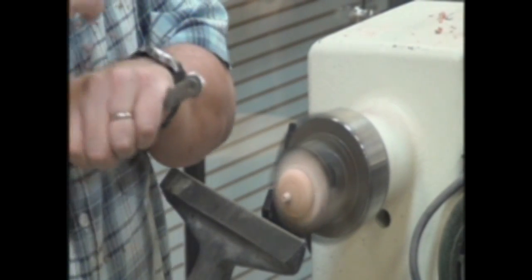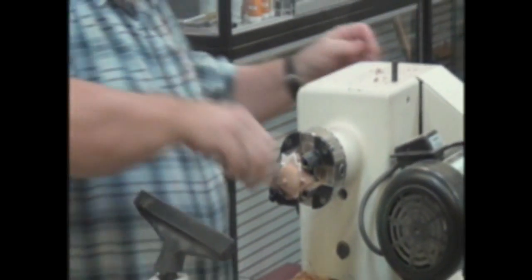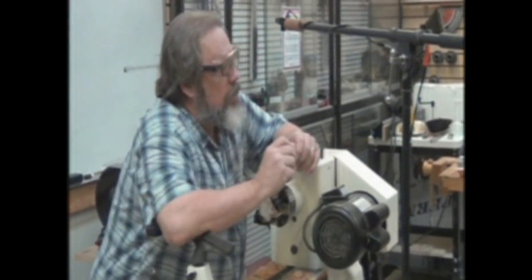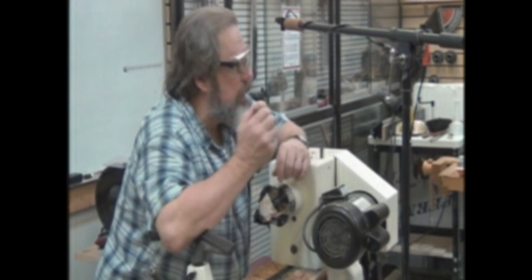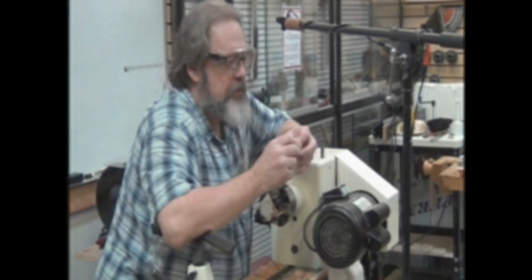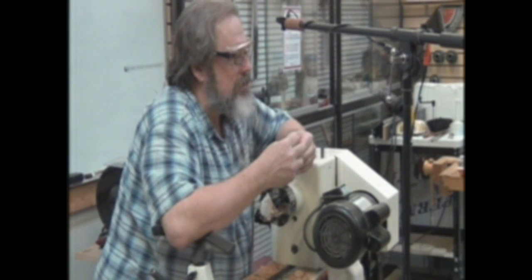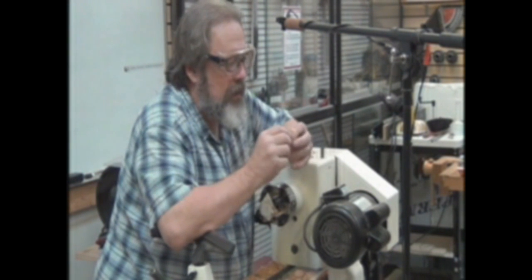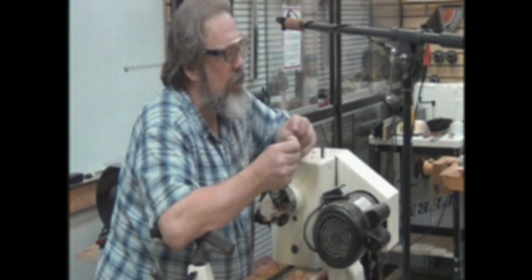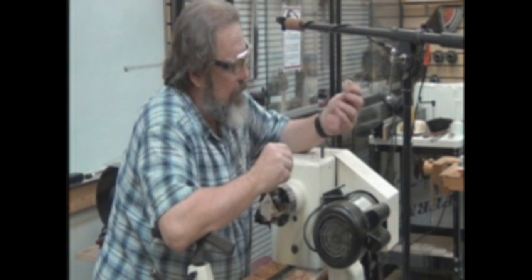You need to oil them every once in a while. For overlapping: if you're trying to make a fine pattern or spiral, you can hear it when it engages — don't press hard, let it wander a little and drop into the groove. When making these, I'd cut three, overlap one or two, then do the next. I like to get close to the stem, so I do that side first before I mess things up. Anyway, that's the cap — we're done with the jam chuck.